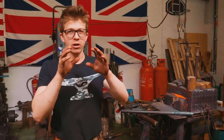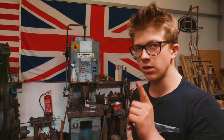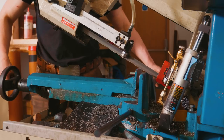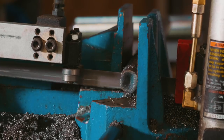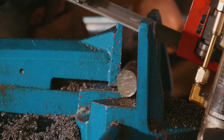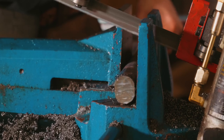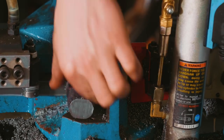Instead, we're going to take normal steel, and the ground finish is not going to be shiny. I think you'll understand why when you see what we're going to be doing for the handle. We're going to have it transition from forged metal to a black oxide cold blue finish as it transitions into the handle — I think that's going to work really well. We're then going to do a cold blue on the pommel, which is going to be a machined pommel. I think this is going to work rather nicely. So we're going to the bandsaw — we're going to make two cuts, one here and then another much further along so we have a bit of holding-on material. And there we go — now on to the grinding room.